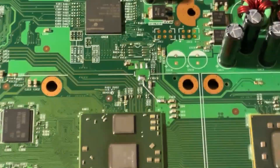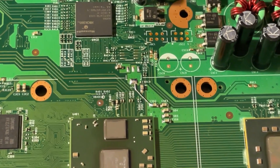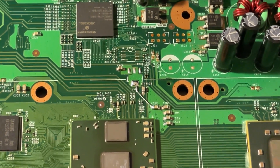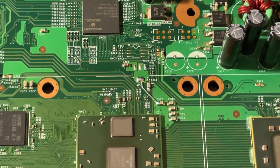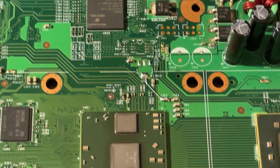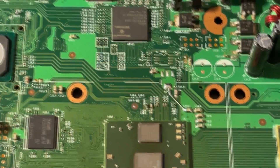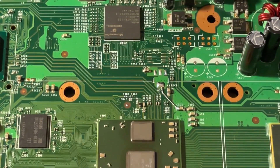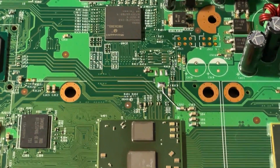The first one you can see up here is I have tied VGPU PCIe to VGPU core with a little resistor leg here. I do recommend if you do this that you cover that with some green conformal masking to prevent any risk of a short circuit, but since this is a development board, I'm not bothering with that. And unlike the Falcon, there are no zero-ohm resistors to reconfigure — you simply remove the regulator and jump it to the conveniently located VGPU core.